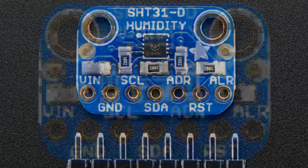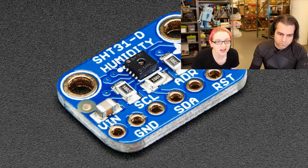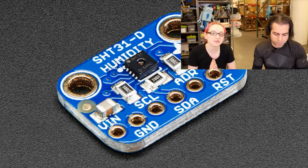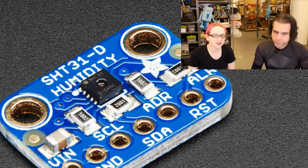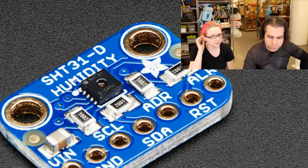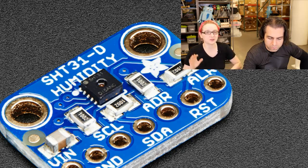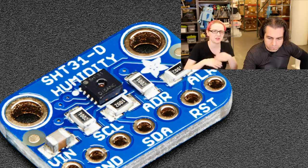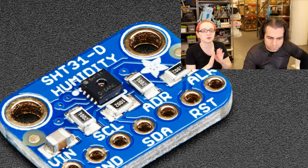This is the SHT31 digital humidity sensor. You might think I have eight bazillion humidity and temperature sensors already — why another one? But this is worth the breakout. The SHT31D from Sensirion makes really high accuracy, high precision humidity and temperature sensors. This is the most accurate one we carry — plus or minus 2% relative humidity, 0.3 degrees Celsius temperature. What's nice is previous Sensirion sensors used a really messed up protocol — not I2C, like two wires but a weird bit-bang. This one is finally true I2C, compatible with all I2C master protocols. It doesn't use clock stretching, thankfully.